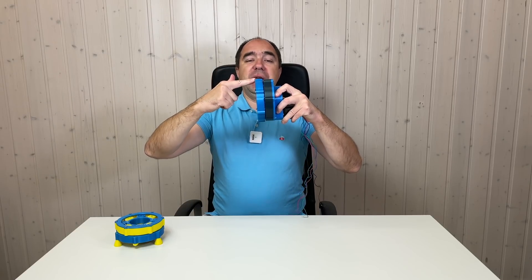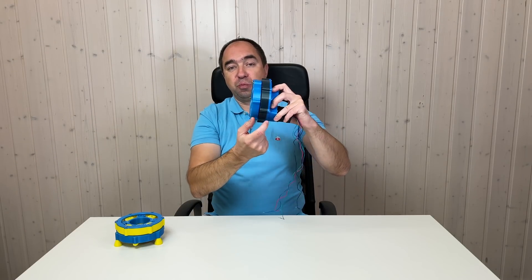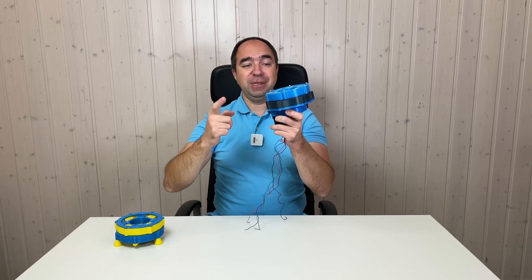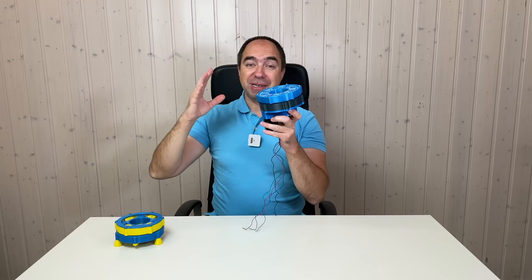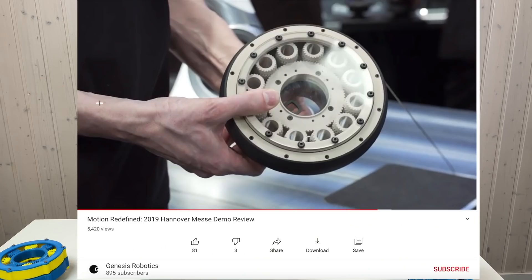In order to improve it, I would like to make a slew bearing — a cross roller bearing made out of plastic. It's going to be 3D printed, and like this it's not going to increase the cost of the overall actuator. The original idea of this actuator came from the company Genesis Robotics. They decided to make a big actuator with a lot of big gears, so they can use just plastic for these gears, and still this actuator should be quite powerful.